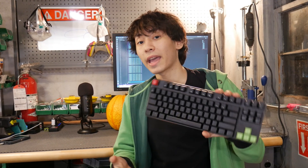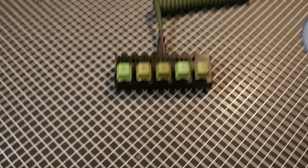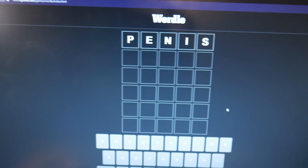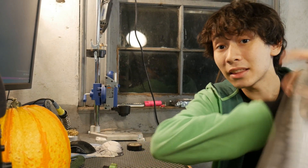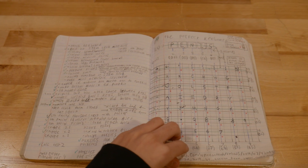The answer to turning a button matrix into a keyboard is QMK. If you're a mechanical keyboard enthusiast, you might be familiar with QMK from flashing your keyboard's pre-made firmware. However, QMK can also be used to make custom firmware, which I'll need to do seeing as there most likely isn't firmware that already exists for a typewriter embedded into a pumpkin. In order to make the button matrix and remember which key goes where, I've had to take the most detailed notes I've ever taken in my life — and these aren't even for school.